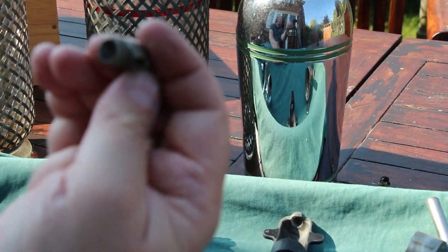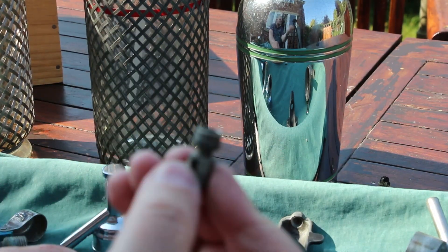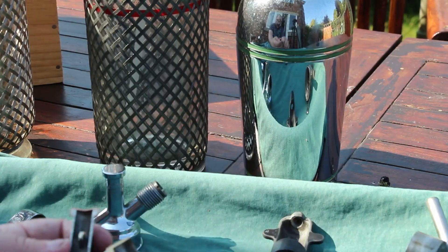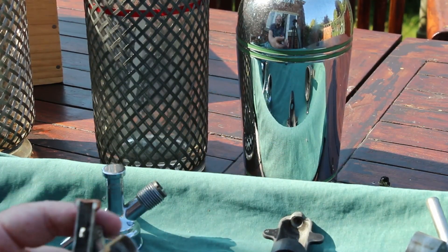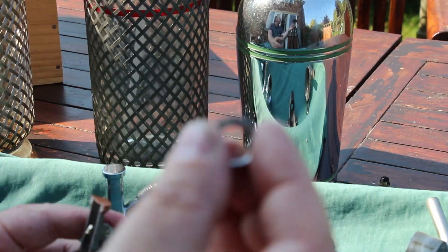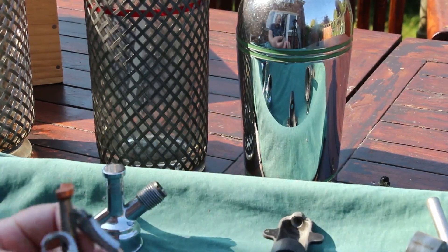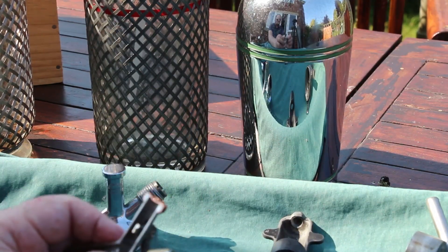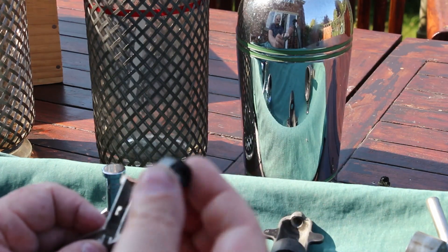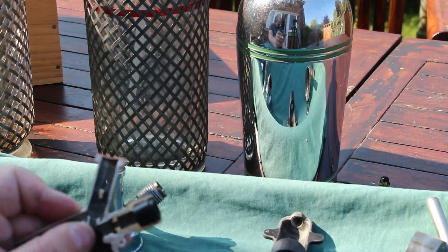From the piston piece, we take the very heavily degraded pad out of the end and replace the o-ring in there with the correct size. Similarly, the ring is unscrewed and removed, which allows you to take out the bulb neck seal — as it's frequently called — so that would have gone in there like that.